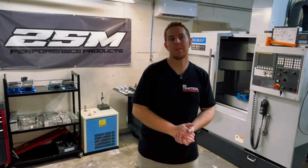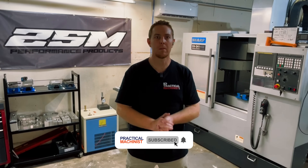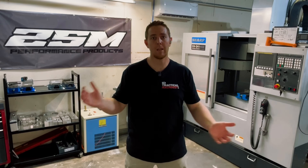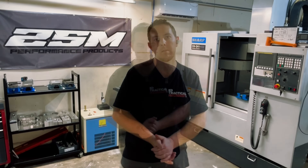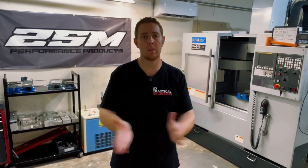On this episode of the CAM Files I'll be going more in depth on the toolpaths that I'll be programming, so I can show you my techniques to achieve different radii and other features that I'll be machining. With a material change from aluminum to magnesium I'll also need to make changes in my feeds, speeds, and radial engagement. Once the parts are successfully machined I can send them out to the customer.